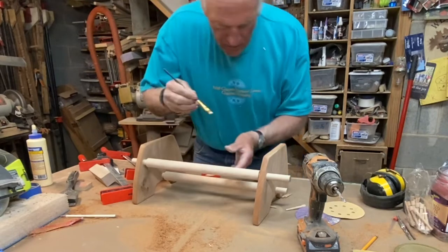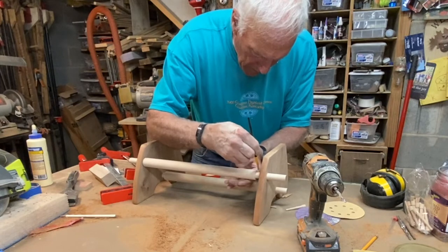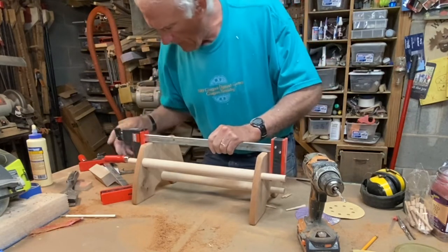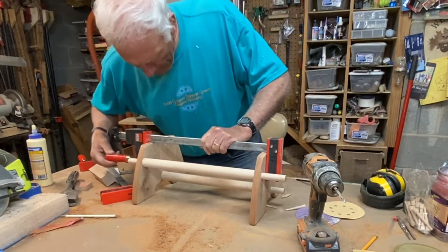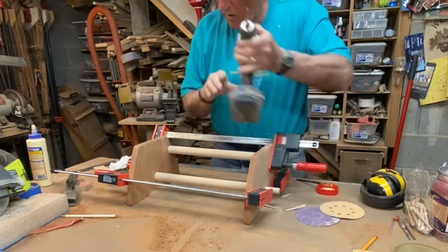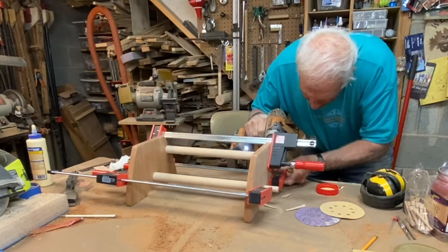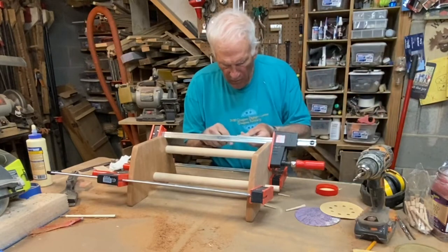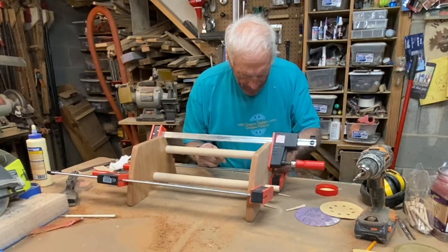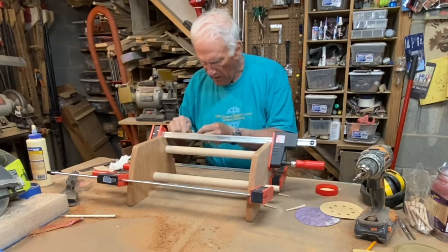And I've got to work carefully because this is a really tight fit, and I'm afraid that even though it's maple, it could swell a little bit. Dead on. All right. That means I can drill for the dowels. Won't put any glue on this sanded part of the wood any more than I have to. These act just like nails. You can feel where they want to stop, and then you can drive them home.